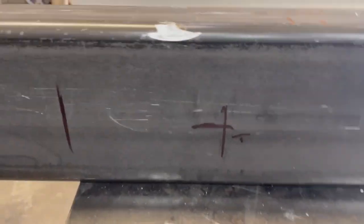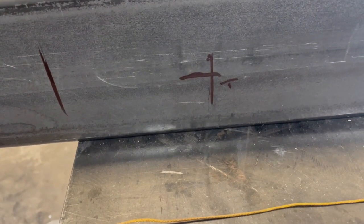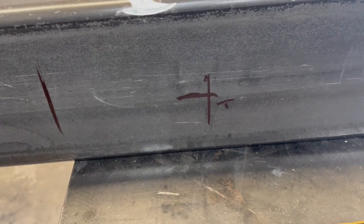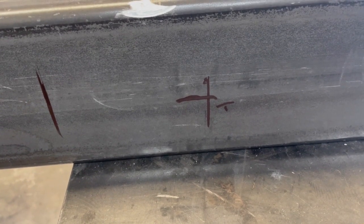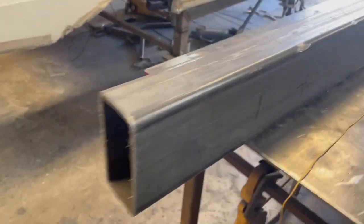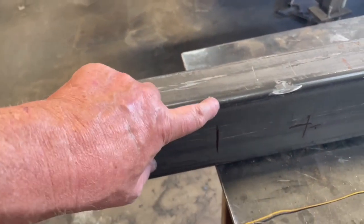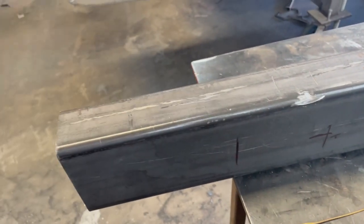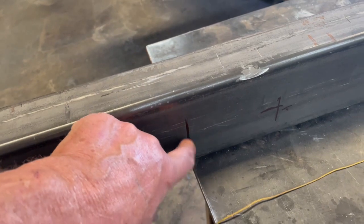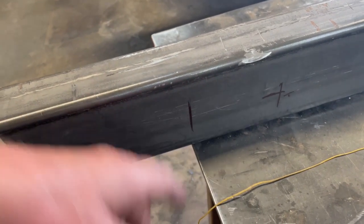This is where the bolt is for the rear spring mount, the front of the rear spring. I'm gonna make it oversized and put a piece of tube in there so it'll be sealed up. Eventually I'm gonna box these off. Yeah, so this is where I'm gonna cut it. This is where the seam is from the floor to where it starts to kick up, so it's a good spot to do that. I'm gonna cut this at a little bit of an angle. It's squared, looks weird, even angle, but it is what it is.